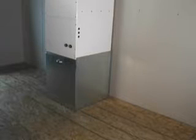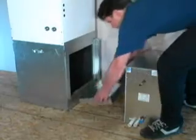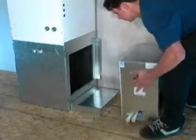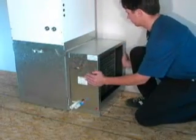When the fan coil is installed on the floor in the vertical position, allow enough room under the cooling module for drain connections. To ensure positive condensate drainage, a small plinth may be needed to raise up the cooling coil and allow for drain connections.